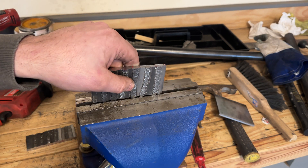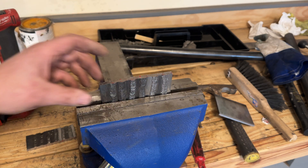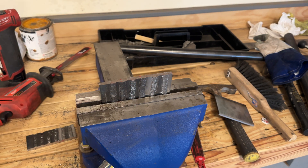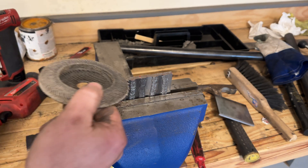So now I'm going to chuck it up in the vise, and I'm going to take an angle grinder with a flap disc and try and flatten this out. The key is you don't want to leave big, huge scratches unnecessarily. I do a three-step process — I start out with a 60-grit flap disc. You could do a 40, I guess, but I start with a 60 or 40-grit first to get it flat.